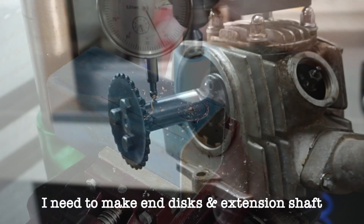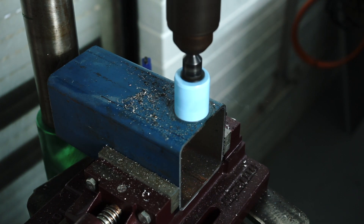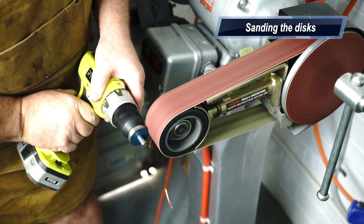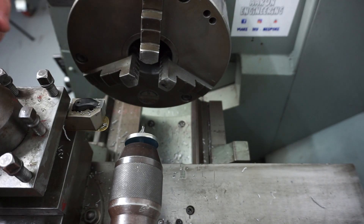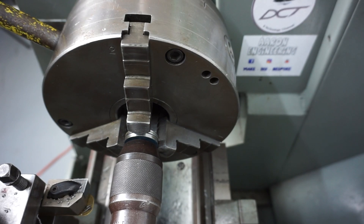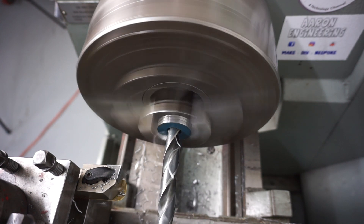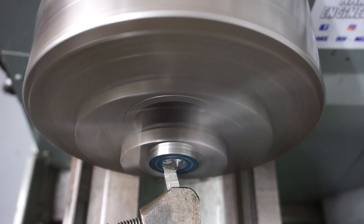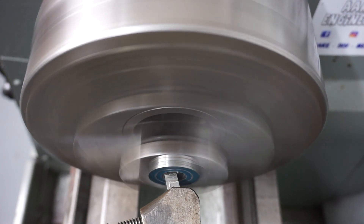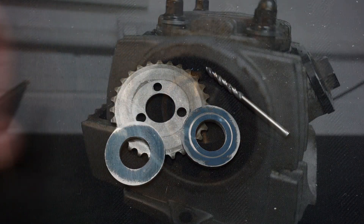Now it's time to make the camshaft extension. I need to cut out a pair of discs with a hole saw over at the drill press - I cut three in total. I chucked them on the battery drill and on the grinder to get the burrs off the outside diameter. Into the lathe and three-jaw chuck to drill the holes out bigger and bore them to the correct size, using a bit of tool steel as a makeshift boring bar.